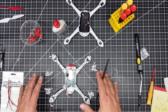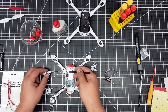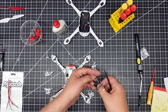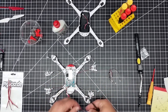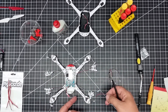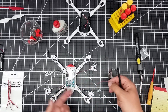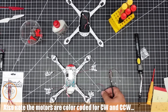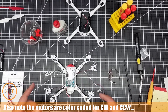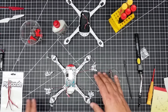This is the first time I've ever changed the motors on this, and it's definitely not a common task because these are soldered in. The motors I got from Micromotor Warehouse - the leads are nowhere near as long as the leads here. So I'm going to have to solder the leads. The only choice I have is to solder an extra longer wire on here. I'm going to clip these wires, solder them on to extend them, then put a little bit of heat shrink tubing over that to prevent any shorting.